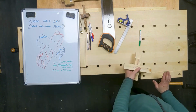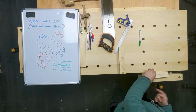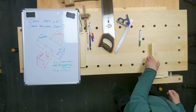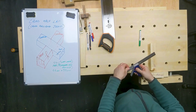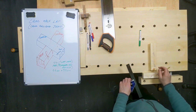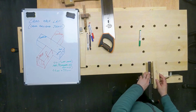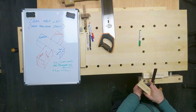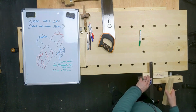Now, we're going to use the vise, and I'm going to mark it up with the help of the vise. It's easier to secure your timber in there. Take the combination square, I'm going to run it down about halfway. I want a sharp pencil for this. I'm going to go approximately halfway here. I'm going to mark out the base. I'm going to run the body of the combination square against my edge. Here's the reference points. It's got to be against that edge. Can't be up top or on a non-face edge side.